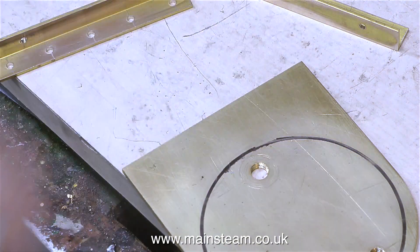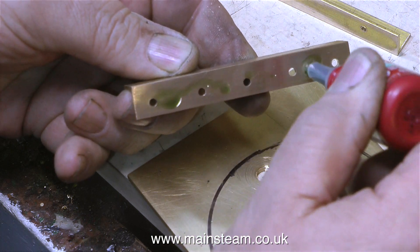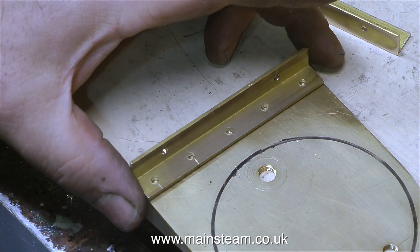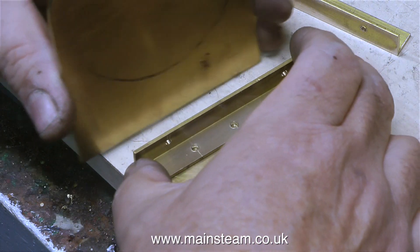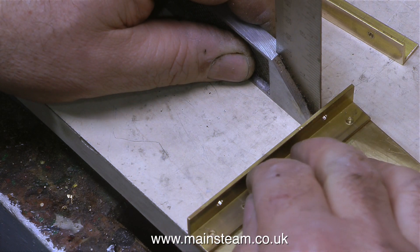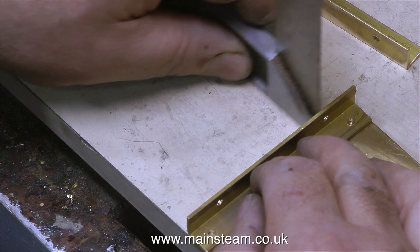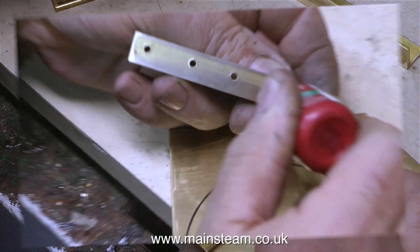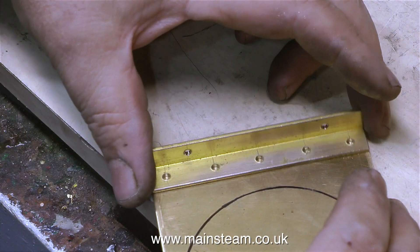After completely deburring the pieces of brass angle on my belt sander, I'm using some Loctite 603 to stick the brass angle to the main pieces of metal that support the condenser. I just find it a very simple way of doing it — I don't have any very small engineering clamps, and even if I did they get in the way. I prefer this method because it's quicker. I just stick the parts together with Loctite 603, making sure they're perfectly square and level with the bottom surface of the side plates. Then I can pilot the holes through the main pieces of metal using the pieces of brass angle as a drilling jig — fiendishly clever and very simple.